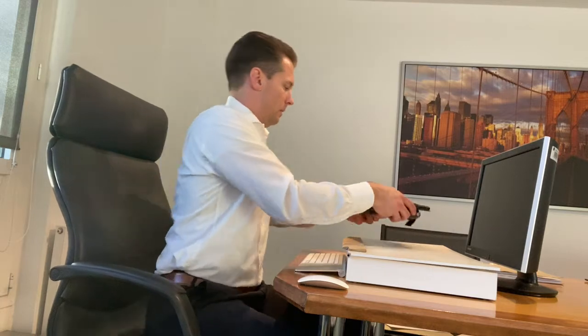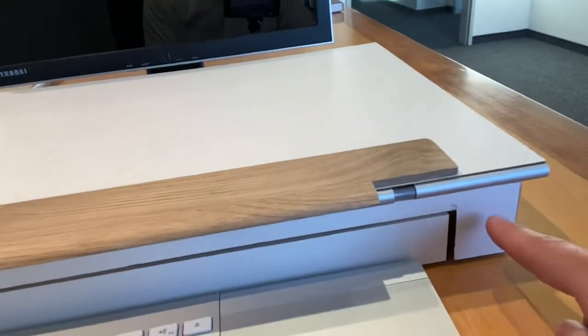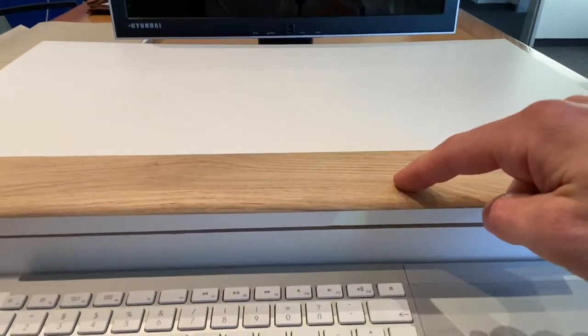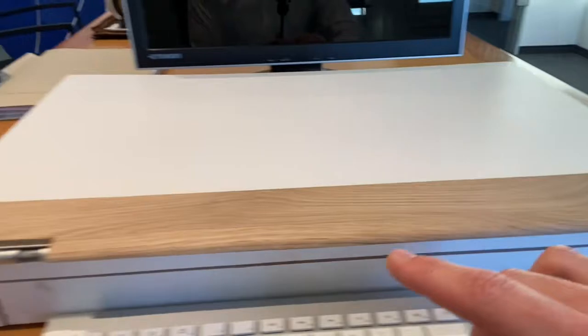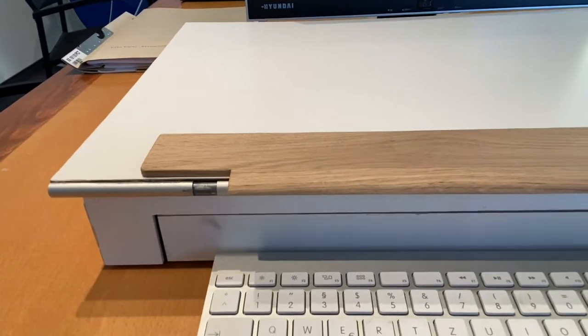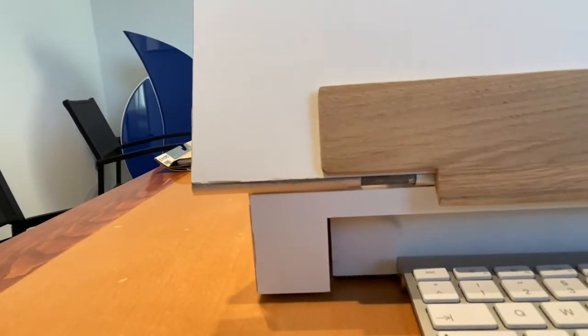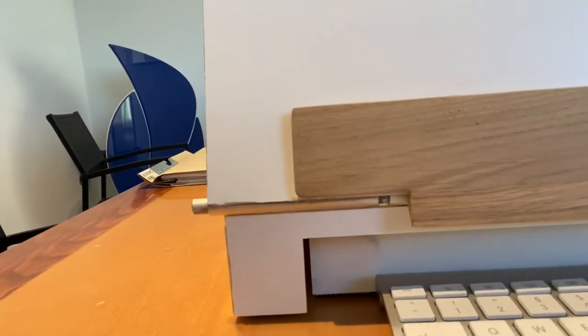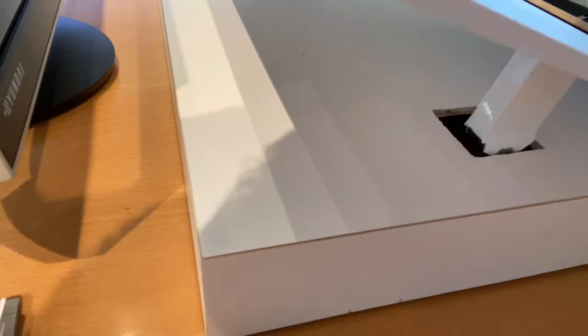So how do we switch the angles in the backmost position? I'll show you that in greater detail now. This joint is adapted to connect the sleigh, the file support, and the file stop — all on this one axle. This axle provides a play in order for the file support to facilitate this horizontal sliding motion, engaging the rollers with different slopes underneath this box.